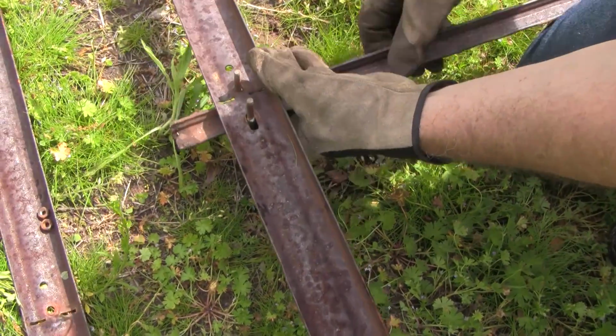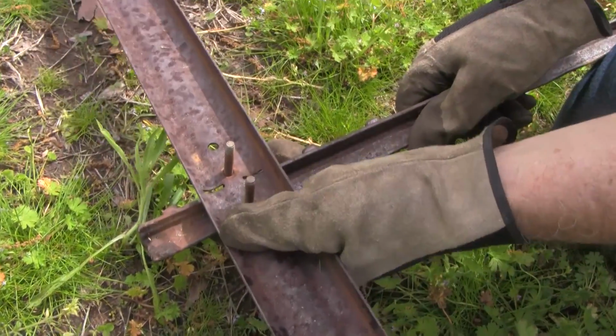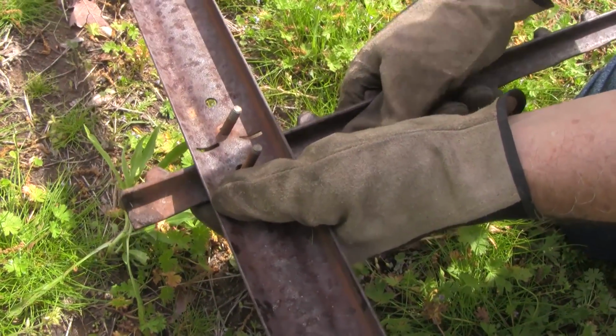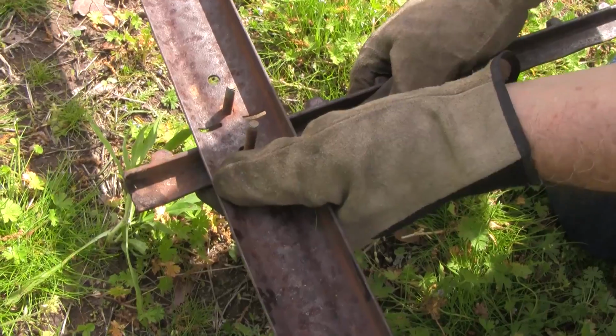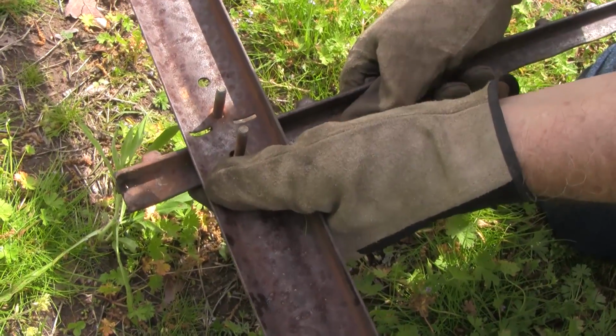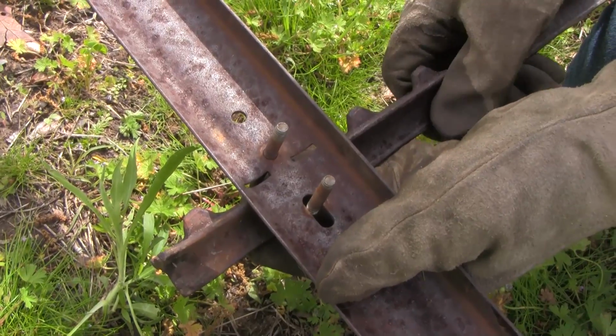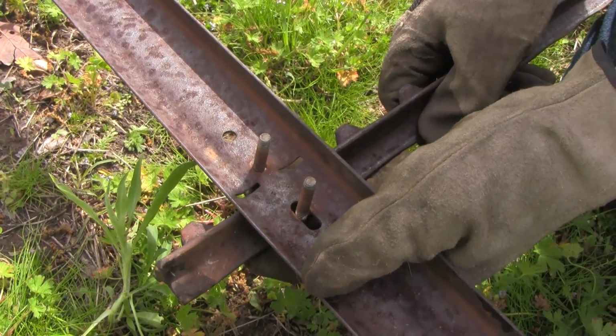Take your screws, put your screws down and tighten them off. Now there's adjustment back and forth, because these don't always drive in the ground just like you want them. They could be turned, cocked, arced. You don't really know. So there's some adjustment. If you want to use a washer on this, you can, and probably even should, but it's not required.